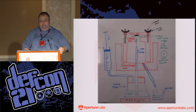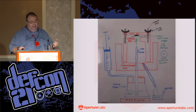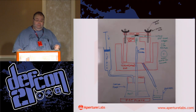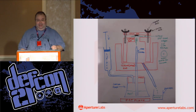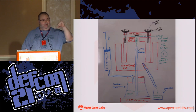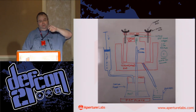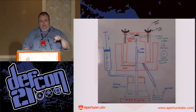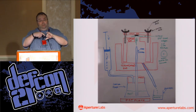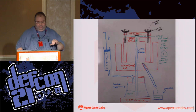Another variable was the temperature. Although I thought I was getting the temperature right, I wasn't. So I got a hot plate, again from eBay, that had a thermocouple probe, which was supposed to be acid resistant and certainly was not. Yeah, no, I went through 2 before I'm like, okay. So I simply made a long tube, sealed the bottom of it with a blowtorch, and injected thermal transfer compound into the bottom of it. Put my thermocouple in there.